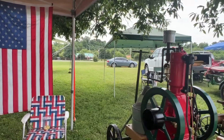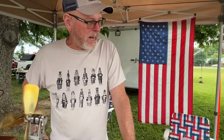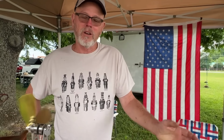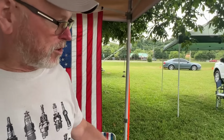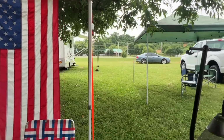What's this one used for? It's a 2-horsepower International, and a farmer might have one engine, but he'd use it on a corn sheller, a grist mill, a water pump. It was used on several different implements. But I don't know particularly what that one's used for. What's the tank? That's the radiator. It pumps water up through the engine and back over the screen to cool it.